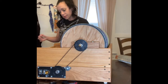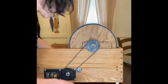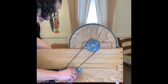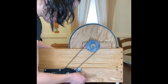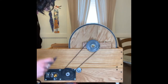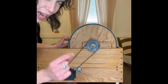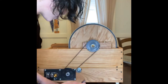The drum is mounted. Now, before mounting the licker in, this is when you're gonna wanna tighten this pulley here. So I'm just gonna use my monkey wrench to go inside and hold this nut. Mount the licker in. Make sure that you get some type of credit card or something, because you always want to mount it so it's just slightly got a gap between it, which is usually about the width of a credit card, very small amount.